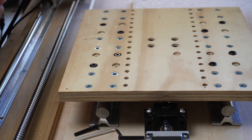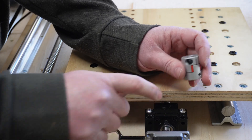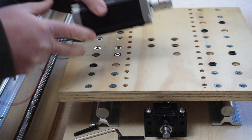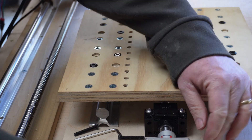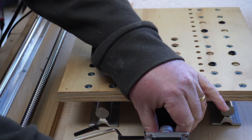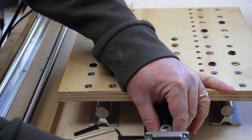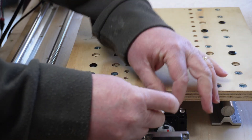The next thing is to put on the coupler. This has a 10mm hole on each side, and the shafts are 10 millimeters. Slip it on — it has a set screw — and get it tight first. We already know the height is right, so slide it in. The advantage of playing cards is they're thin plastic and you can see the coupler glides on with no problem. Rotate and tighten down the other set screw. I like to have it just a little back so it's not touching the actual shaft end — otherwise the two shafts will hit internally.